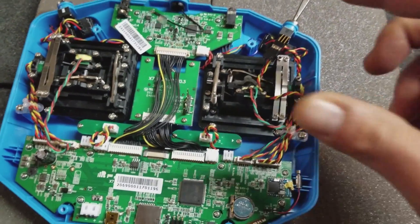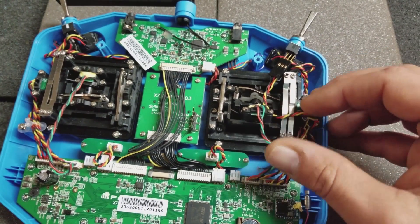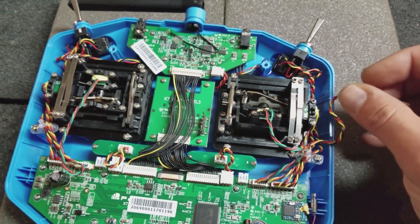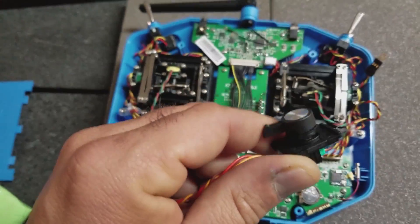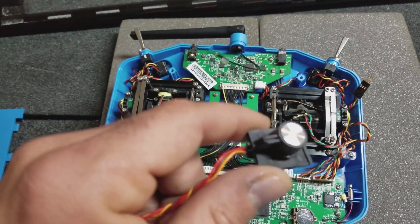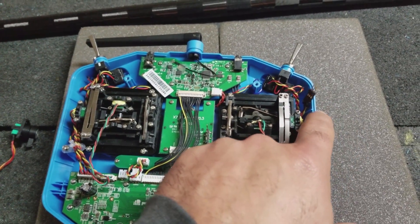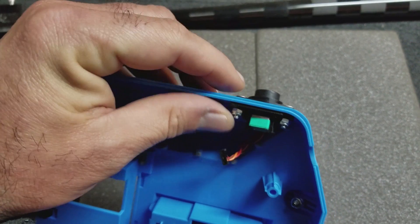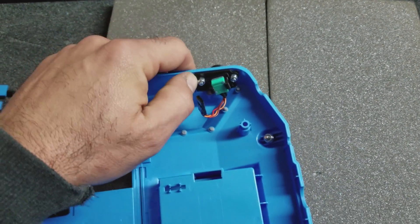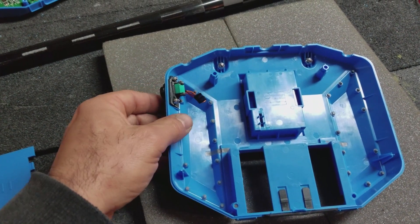That's basically it — it was pretty easy. The design work was the hardest part and then 3D printing the parts. If you have a 3D printer or a buddy that has one, you can do this yourself pretty easily. Just order up these sliders — I'll leave the part numbers and links in the description. You need to 3D print basically 3 parts, and you need a couple of flush mount 3mm screws, about 10 or 12mm long, and a couple of lock nuts. And that's basically it — you can have a slider on your X7.